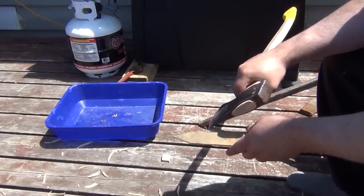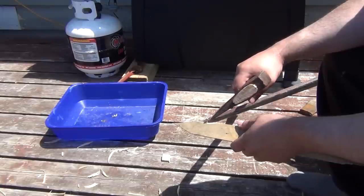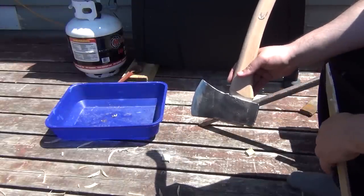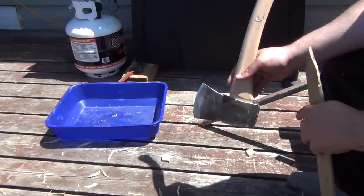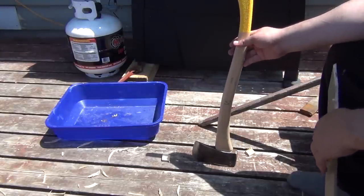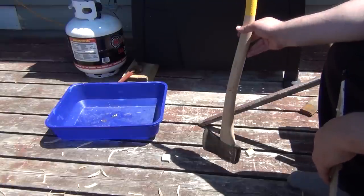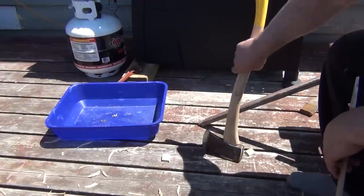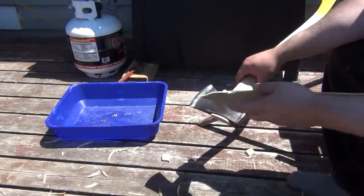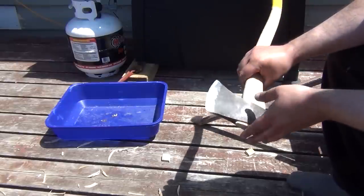See the splitting that's happening right there in the curls? That's because the bit is so thick, it's making the wood bend past the point where it's elastic, and it's just cracking and splitting along the grains. Now again, that's a choice I made with this, because I'm trying to get durability over cutting ability. These axes are both used really severely — when I got them back there was even caked-on mud on the head. They're sodding axes, utility axes, root axes. The poles are used to bust up concrete. So the bit I've put on them, while very sharp, is so thick that it will tend to buckle wood rather than neatly slice it. But it will have decent chopping ability anyway.